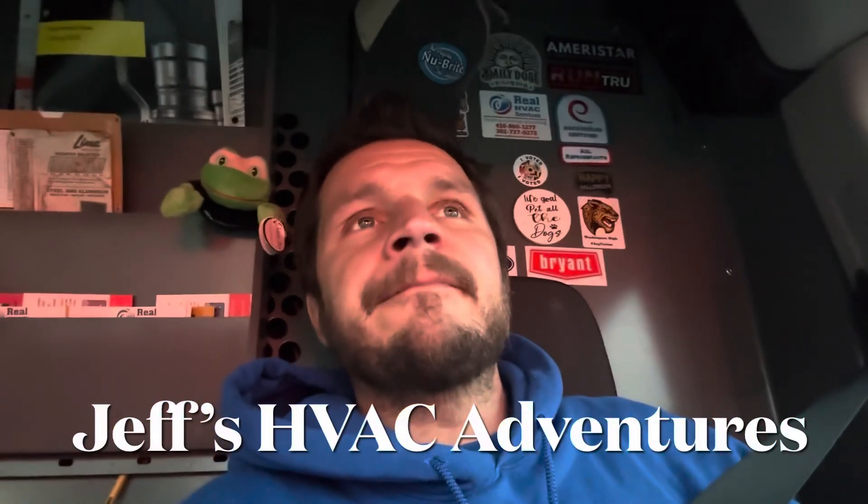What's going on guys? It is December 4th, 2023. We got into two calls today — well, I got into more than that, but two that I filmed. One was a leak search that I wish yielded better results, because what I found kind of feels like a cop-out, but it is the only leak I could find. And the other one is following up on another technician that diagnosed a bad draft inducer and ignition control board, so we install those a little bit later.